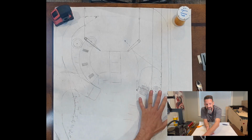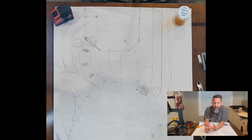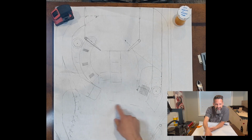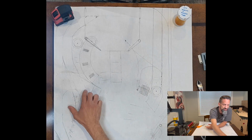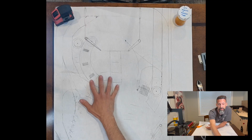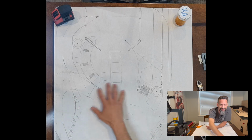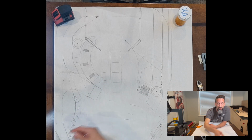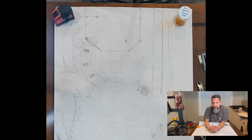Now, when I show the actual playfield in the next video, you're going to see that when I actually started laying it out and prototyping it on my whitewood, cut to the right size board with cardboard and things like that, my shots didn't quite fit exactly the way I had them here. It was not quite as precise as I thought I needed to be. Once I saw how much space I actually needed for the ball, a couple of these things were too tight. I didn't have good clearance in all of this. If you know anything about pinball, you can probably see some issues with this initial design. But we're able to get out here, start laying it out with actual cardboard and foam board on the wood, tweak some things, and I'm really pleased with the direction it's going.